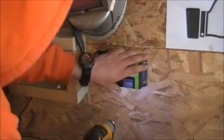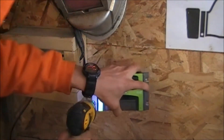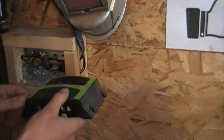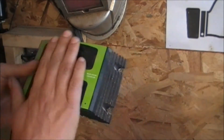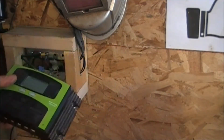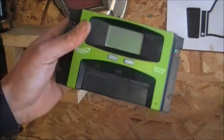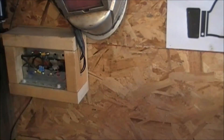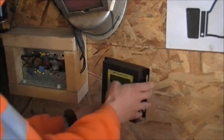I'm going to put the 100-watt kit that I originally bought — this charge controller and the 100-watt solar panel — up for sale, and I'm going to get a 250-watt 24-volt panel to go into this system. The old charge controller is a 30-amp Pro Vista, so we'll get this new one mounted on the wall where I want it.